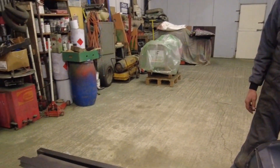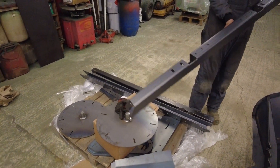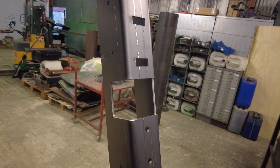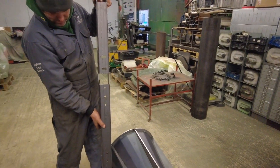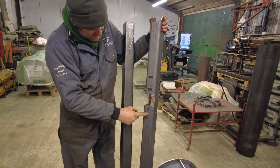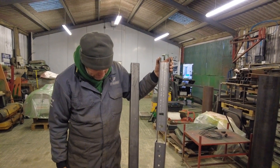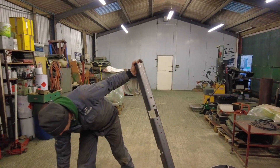There's two of these to put together - that's all the stack of steel that makes up the other one. And this is a fancy bit of steel - that's the benefit of laser cutting. This is cut and folded to help us align everything. I'll show you when it's on what each of these different bits does. This basically replaced that - that's what we'd used before and welded everything to it. Although this is more expensive because it's cut and folded, it actually makes assembling, welding and fabricating a lot easier.